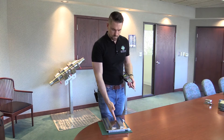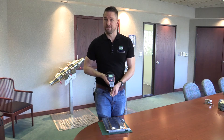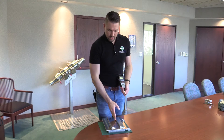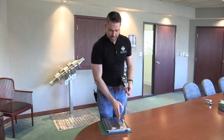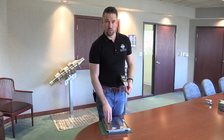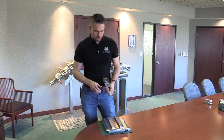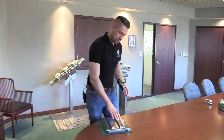In order to do your test, we always recommend testing on the first step. We're going to be using a half-inch test ball — there are other test pieces that can be used, as well as gradient testing, but for simplicity and consistency we'll use the half-inch test ball. We place it on the first step because this is where most of the magnetic material is captured; the second step back here is weaker and captures less tramp metal.